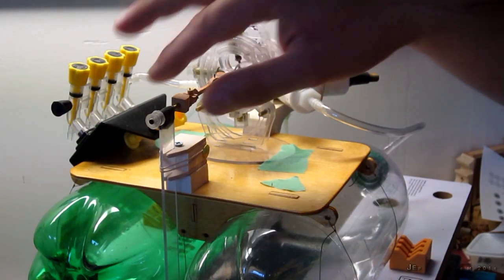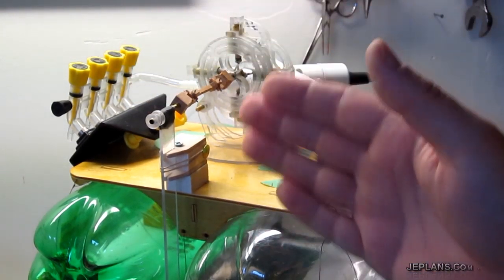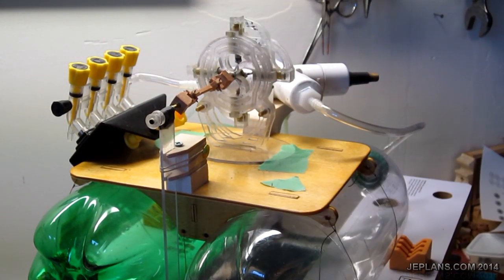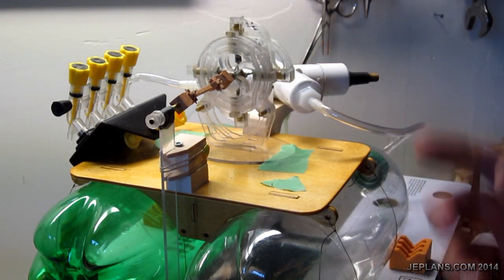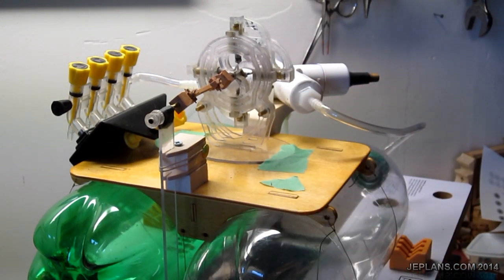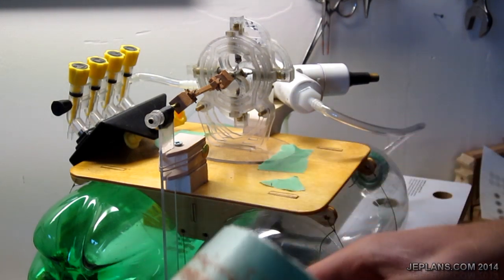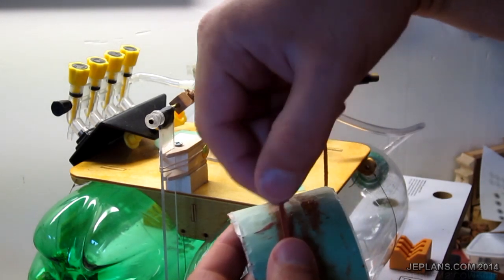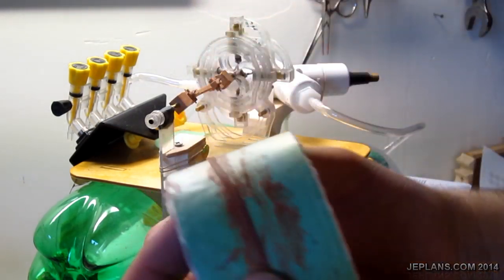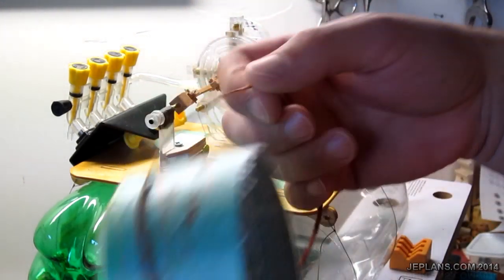To address the belt drive slipping issue, I'm going to need a thicker belt. So what I did was take that same cotton string, wrap it around three times, then kind of secure it in one spot, and then put some wax paper around a roll of tape, and then coat it in silicone and just kind of did it section by section to make my belt.